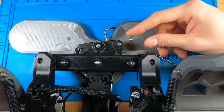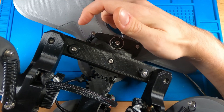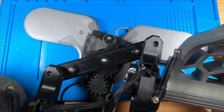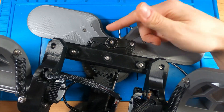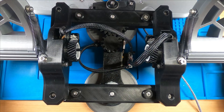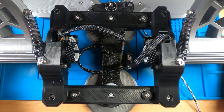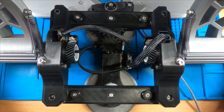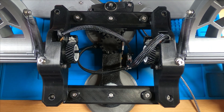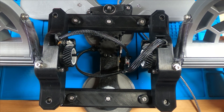Lastly, we have our centering mechanism right here. The centering mechanism uses a strong spring located under here to return the pedals to center. The stronger the springs that you use on both the pedals and your centering mechanism, the more resistance you're going to have when pushing these pedals. This design is quite a bit larger than the other ones, so I've decided to take a little bit different direction with the build guide using Fusion's animation workspace. Let me know if this is more helpful. If it's not, leave me a question in the comments and I'll try to clarify.